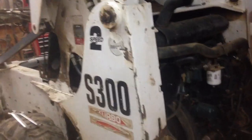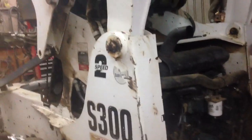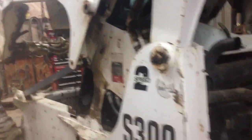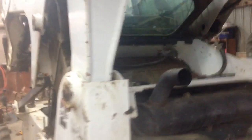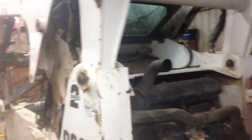Overall it's a good running machine. I did have some trouble starting the engine — it was about 20 degrees when I went to start it. It sounded like only one glow plug was working because it would hit on one cylinder for a minute. I'd cycle the glow plugs again and it hit on two cylinders, and after the third cycle it ran fine. There was white smoke when I first started it cold — diesel smoke — but it cleared up after it warmed up with no visible white smoke after that.